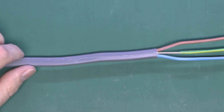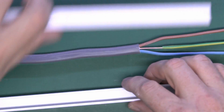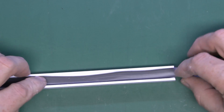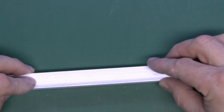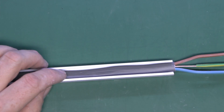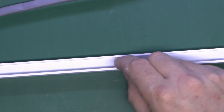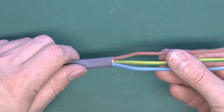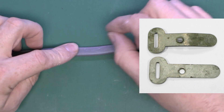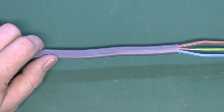If the cable won't be in an area likely to get damaged, you can clip it in place with these plastic clips. Another option is miniature plastic trunking with a removable lid. This one is self-adhesive — you peel the back off, stick it to the wall, the cable fits in the side, and the plastic lid clips over the top. You can get this in various sizes; this is a fairly small size for one cable but larger sizes are available. Even if self-adhesive, you may want to put a few screws through to ensure it doesn't come away from the wall.